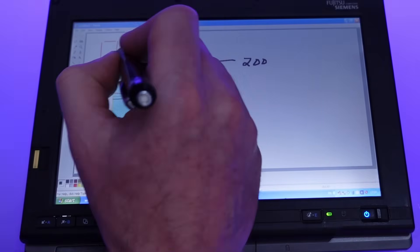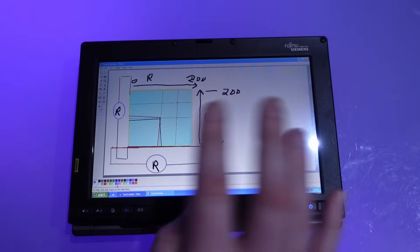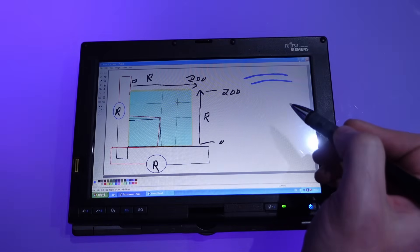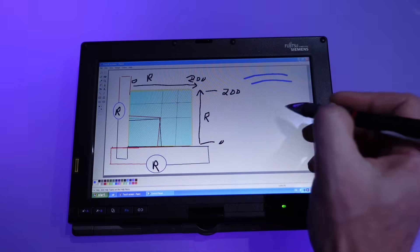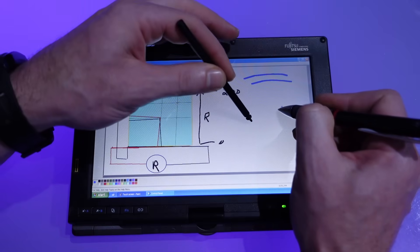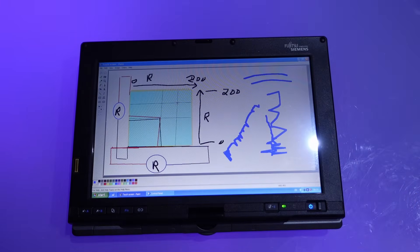The point where those two cross is the position of the stylus. Moving the stylus causes the resistance to change and the computer can track the location. This is a very simple and very effective way of monitoring the pressure point at which the pen is on the screen. There's no variation in pressure — it's either on or off. And if you have two touch points as we're used to on smartphones, it adds the sum of the two, giving you a line running between the two points.